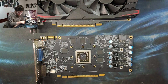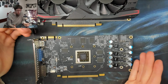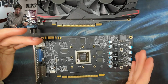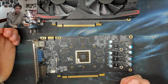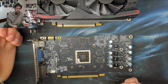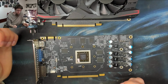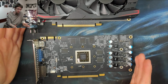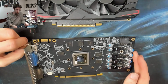Interesting. So that's just it. From an objective point of view, initially when we first started messing around with these, and we were trying to make it work in Windows 10 and stuff like that, we thought we had faulty cards. The interesting thing is we don't have a faulty card here at all. We just have a really bonkers Frankenstein card where someone has just bashed numbers into the BIOS, almost making it up as they go along, just anything that they think looks vaguely plausible. And the card does actually work.